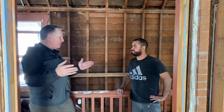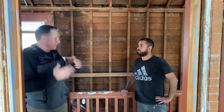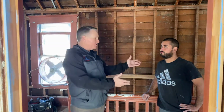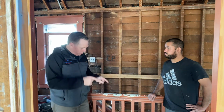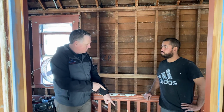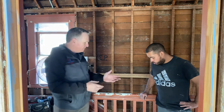Roger, you were talking about sealing the plenums and getting all that done, and I know that in the past I've been in the trade for a long time. I've installed, done service, everything, right? But I leave the technical installation to the guys that really can get out there and do it. But I know when you put a collar in a plenum, and then you put the mastic on there, when you're messing with that, it can break holes in the mastic. So how do you prevent that?